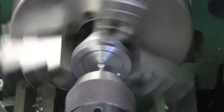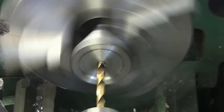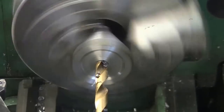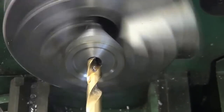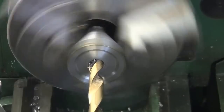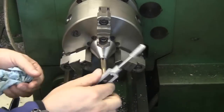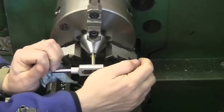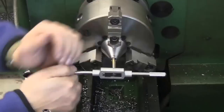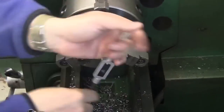Now I'm going to center drill and drill the hole through the rest of the way. I only want threads about halfway through the jack stand, and so this hole is connecting up with the hole I cut in the top and threaded. I'm going to expand this hole big enough to let the bolt come all the way down in there. Just a little chamfer to clean up the bottom. Then I came back through and cleaned up the threads to make sure there were no burrs at the bottom of that hole since I drilled into the bottom of the threaded hole — about a quarter inch or so to complete that hole.